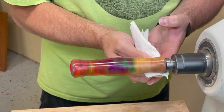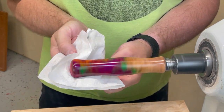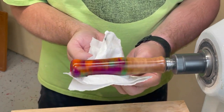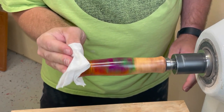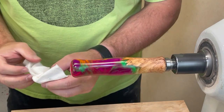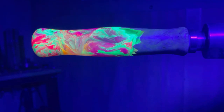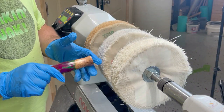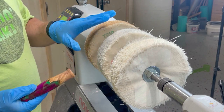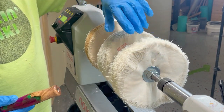You can kind of feel when you're done — when you're finished, go over to the clean side, get the excess off. Don't push too hard — we're just trying to get the excess off. You're finished when nothing more is coming off. Yorkshire Grit is not a finish, so these buffing wheels are what I use. First one is Triple E, white diamond, and this one has carnauba wax on it — so let's get these buffed up.